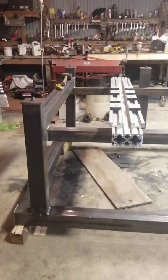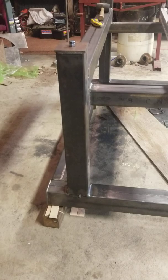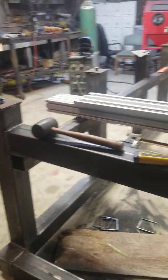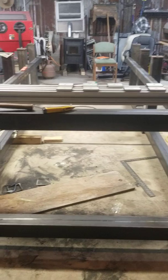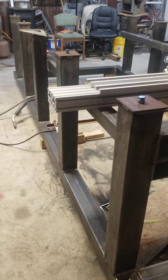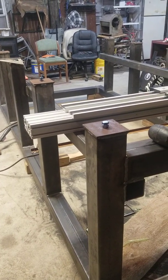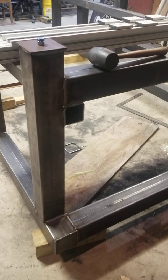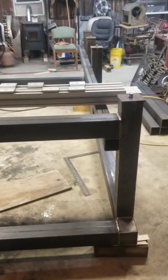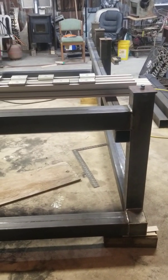Back to the table - this is going to be a good table, I can't wait to get it finished. I'll get my other metal in - it's going to be about a week, I messed up and didn't get one piece ordered to finish it. Another day we'll have this thing flipped over and be thinking about putting some rails on. Just wanted to show everybody what can be done - just got to have a square. We wore out more tape measures keeping everything measured right and square than anything else when you build a table. It's upside down here now, but I cut little end caps and put them on my four inch pipes just to look better. I'll try to do more videos as we go - it's going to be pretty nice.